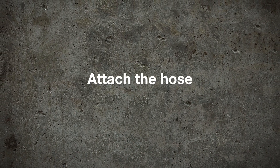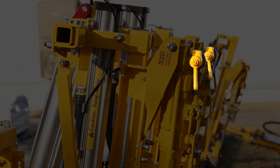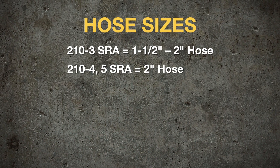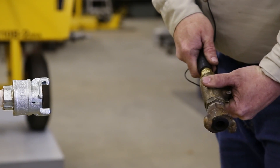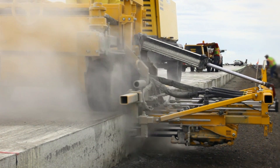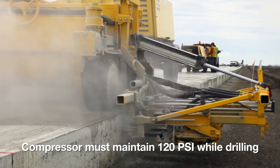When attaching the hose to the drill unit, first be sure the drill motor lever is parallel to the drill motor — rotating the lever will shut off air to the motor. Then make sure you are using the correct size hose: the 210-3 SRA must use a one-and-a-half-inch to two-inch hose; for the 210-4 and 5, you must use a two-inch hose. Before attaching the hose to the drill, blow air through the hose to clean out any debris. Connect the hose fittings, install the safety pin, and it is also recommended that a whip check be installed as a safety measure.